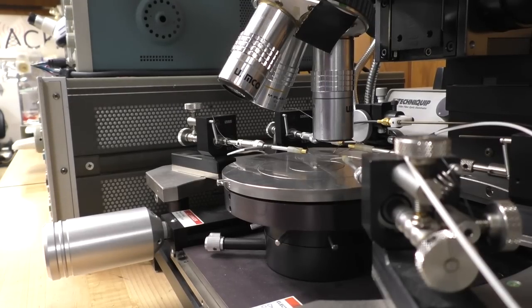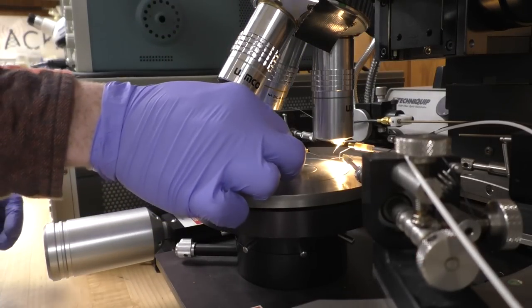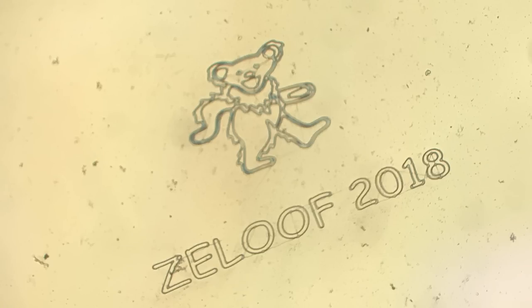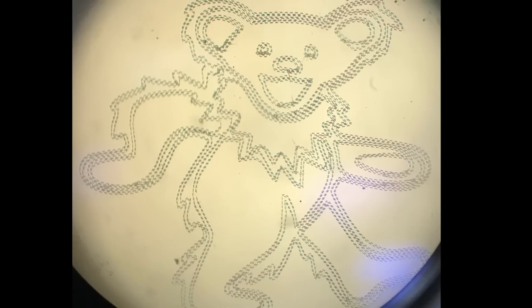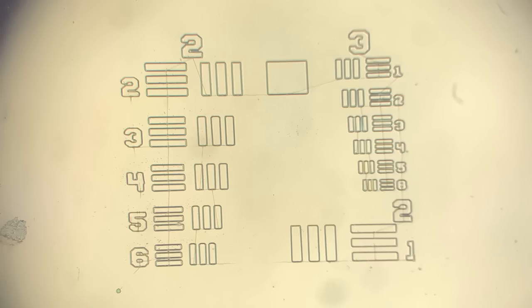Next up we'll inspect it, so I'll throw it in a microscope — the most convenient one was just this wafer prober, so I'll turn the light up and put it in there. So I'll end the video by showing pictures of some stuff I've made. I haven't had that much time to mess with this, and obviously there's a lot of room for improvement. The beam blanker is only partially working — you can see these lines, like strings, connecting everything. And you can also see all these dots within that area when you zoom in, and that's because the 12-bit DAC I chose is not quite enough, and it is a digital scanning controller. So that's all for this video — I'll probably make some more on this topic, but I hope you learned something, and thanks for watching.